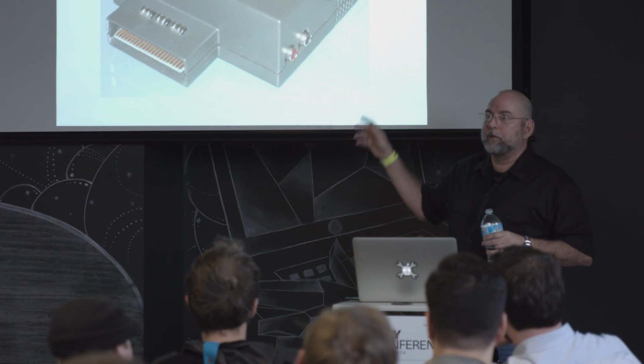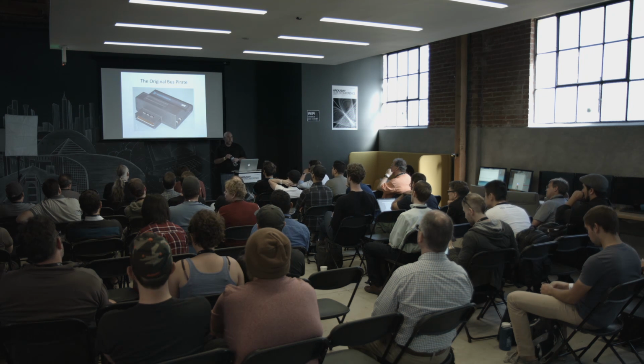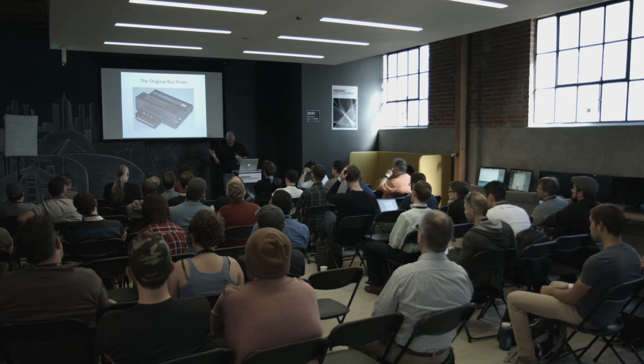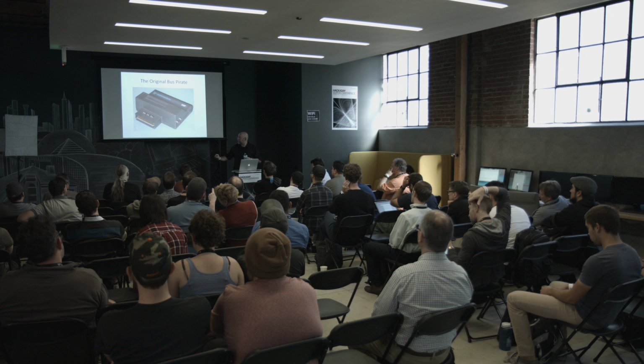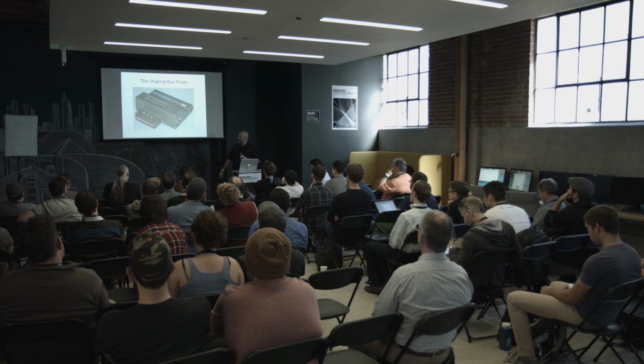So to fix this, and again, we're going to do it overnight, right? Stay on schedule. I thought of everything I could do before I did the next thing, and that was the Z8000, or the Z80. Remember we shoved that sucker in there just to save some power? He starts at a different address, 0000. His reset line's high, the 6502 is low, I stuck an inverter in there, now the Z80 turns on first. He goes, I'll just go get some memory.